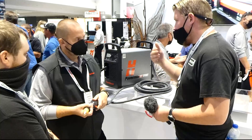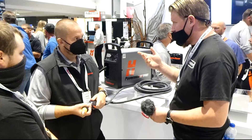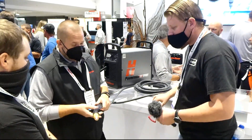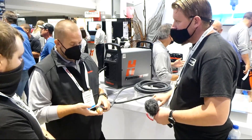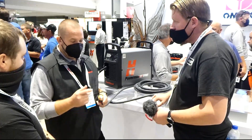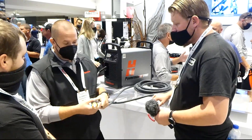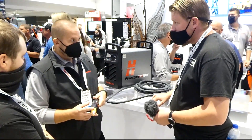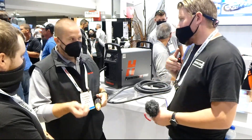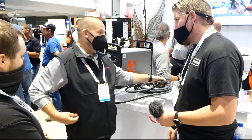Say you've got people running into problems — pulling the trigger and getting a 030 code for a 45 or a 65, torch stuck open. Those are significantly reduced with this design. And another advantage of the data: one of the data pieces we're tracking is error codes. So if you're getting error codes while the machine is running, the cartridge is storing that. We can extract that data. We could ship that cartridge back to you and say, hey, I can never get this one to fire.